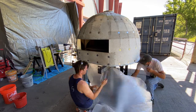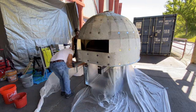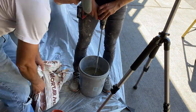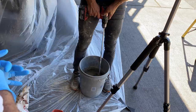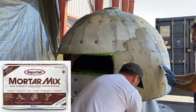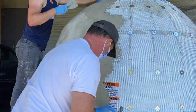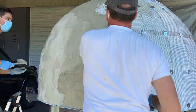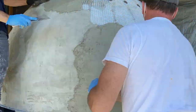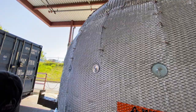The whole premise of this video is obviously how to tile a rounded surface. Your project might not need this next step, so if you don't, lucky you — just skip over a few minutes. But if you do, this is a very valuable step to know. We are specifically encapsulating this mesh fencing with mortar mix from RapidSet because it sets within 15 minutes. This stuff hardens extremely quickly — you can actually feel the heat coming off the product as you're applying it. If you need a little extra working time, you can always add a bit more water to the mix.